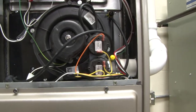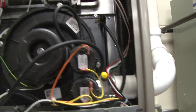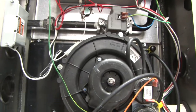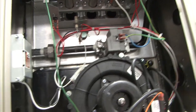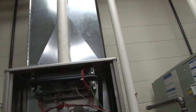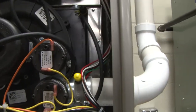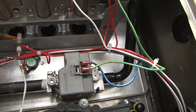There are a lot of safety components to make sure that the furnace is safe when it's operating. We have pressure controls, and these pressure controls are sensing draft inside of the combustion chamber to make sure there is air movement through it to keep the flame and the heat moving through the furnace, preventing it from backing up into the room, and forcing it out through the pipes.